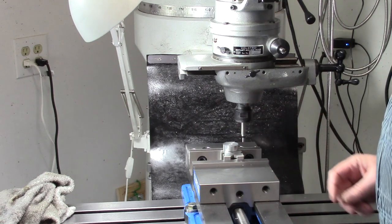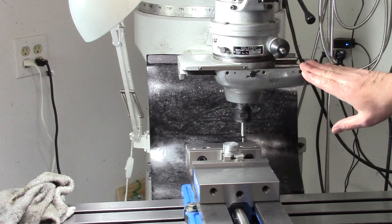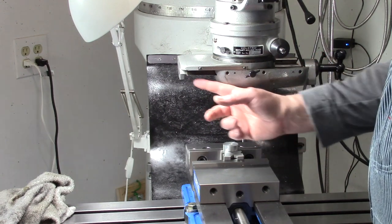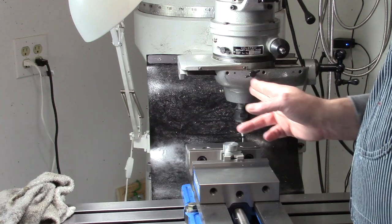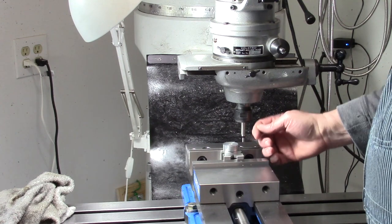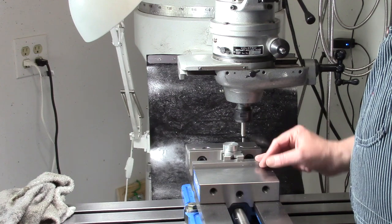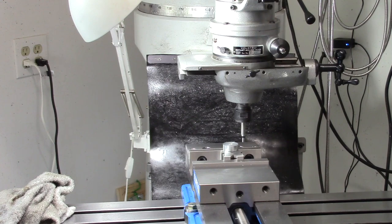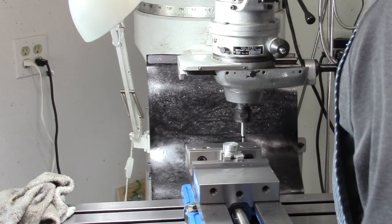So they fit fine. The way this works is it can go 360 degrees radially, or in a circle. And then you've got about 3 inches, or 75 millimeters or so, of travel. So you can offset your radius and then swing it around, and you should have the arcs that we want. So we're going to try this. This is the first actual job I've tried to use it on, hence the scrap piece of aluminum in there to find out if it's going to work.